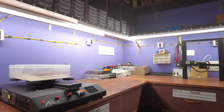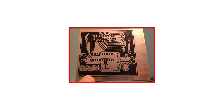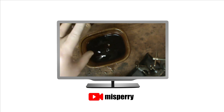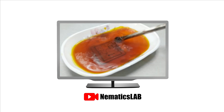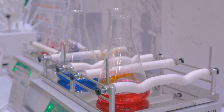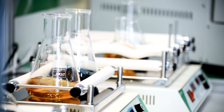Curious about how this feat is accomplished? Allow me to clarify. In homemade PCB creation, particularly through the toner transfer method, many individuals adopt a straightforward approach. They pour ferric chloride into a plastic enclosure and fully immerse the copper clad material in the solution. Afterward, they allow the chemical reaction to transpire over an extended period. To overcome this difficulty and expedite the process, a technique known as agitation mixing comes to the fore. This method effectively combats inactive zones within the etching solution where chemicals become depleted or where the solution fails to penetrate.